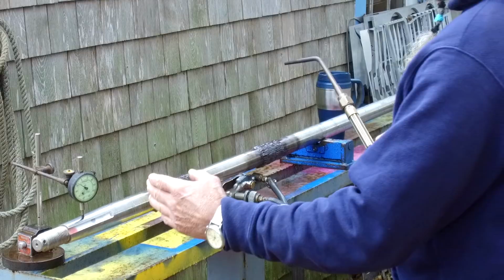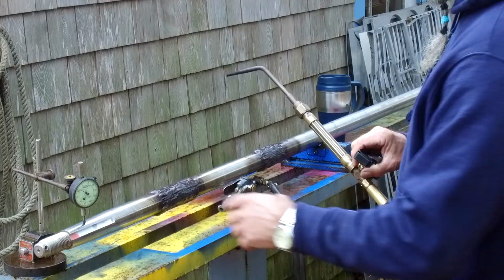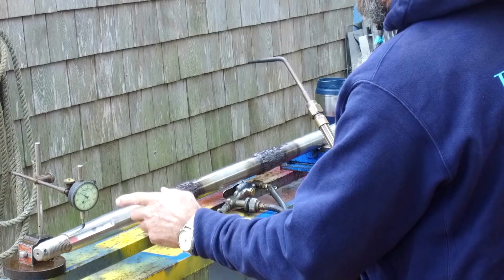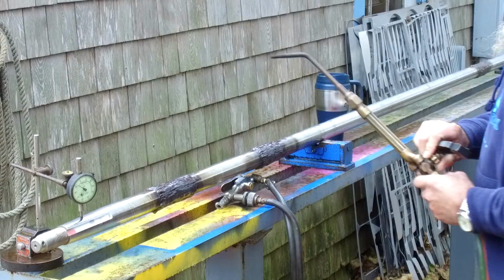Sometimes when people don't straighten shafts beforehand, they actually will hold it in the lathe, machine the taper, and then when they let it go, the taper's not running true with the axis of the shaft, and that happens a lot. If it's spinning in a lathe, I can see the finished machining mark. I can tell whether that was done or not, because you'll see that wobble back and forth. If it's a true running shaft and a true running taper, you'll see that line stay exactly steady, or vary very slightly, that's all.